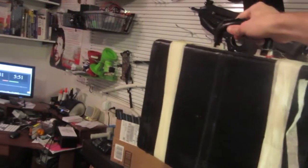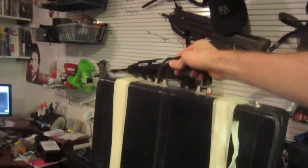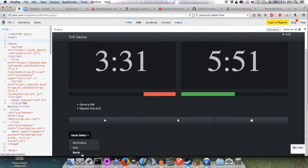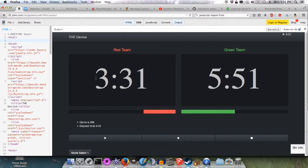In intel mode we're going to put a bunch of LEDs on the case. When you're carrying it the case is dark, but if you're shot and forced to drop it, the LEDs turn on and in a night game the case would be easily retrievable. Bomb mode is for Counter-Strike where the terrorists have a bomb and have to arm it in one of two positions. The bomb has to be armed using a code — there's no keypad yet but I'm out of pins so I have to figure that out. In domination mode the first team to get to 15 minutes wins. There are little progress bars, and start, pause, and stop game controls for the admin — they can just pull out their phone, go to the Raspberry Pi's IP address, and control the device.